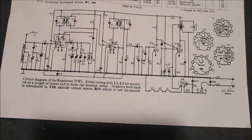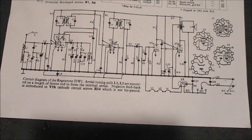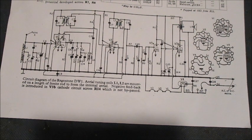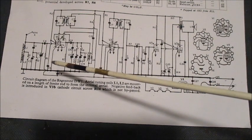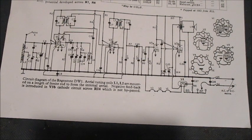We therefore require an RC arrangement. The capacitance here is C8, 47 nanofarad, which provides a low impedance path to chassis for the carrier frequency in the tuned circuit and permits the AGC voltage to be applied to control grid 1 of the RF amplifier via that tuned circuit. That signal also passes via R1, 680k shunt resistor, to grid 1 of UCH81. Blocking capacitor C4, 100 pF, prevents the AGC voltage being short-circuited to deck through the low resistance of the tuned ferrite rod coils L1 and L2.